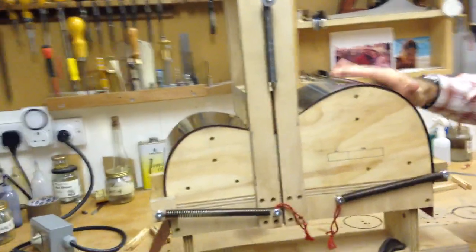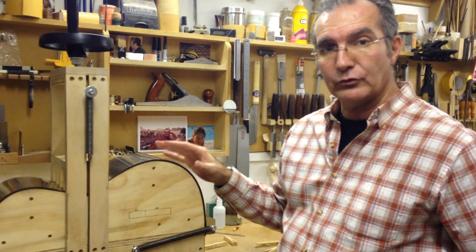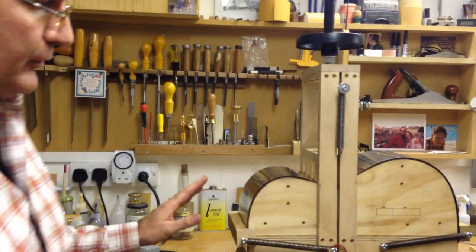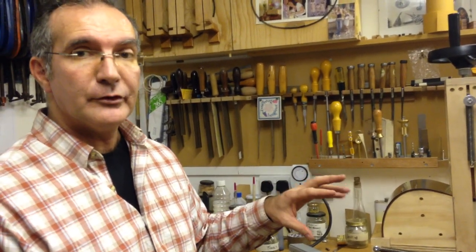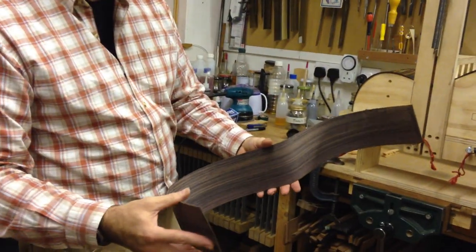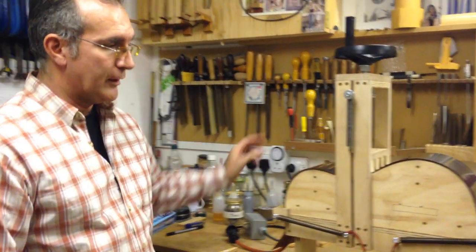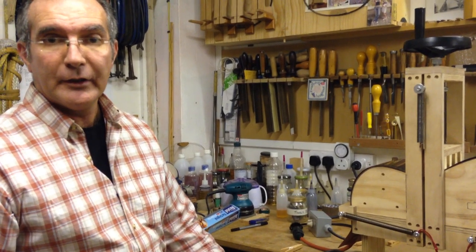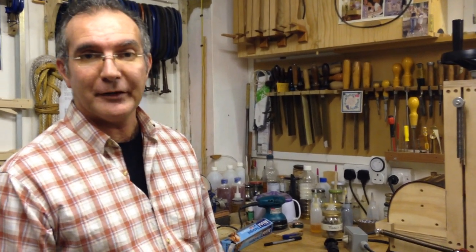Now I can leave it there, but because these are bindings with glue keeping them together — not sides — if I keep heat on for too long they're going to come apart. So I'm going to switch it off and that's as much temperature as they're going to get. Tomorrow when this is completely cold I can take them out and they will have exactly the right shape. They have some spring-back but it's not a problem — the shape is well enough to be used. I hope it's helpful, and if you have any questions send me an email. If you like the video, press like and subscribe for more videos about guitar making. Thank you very much.